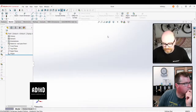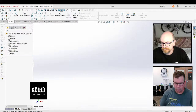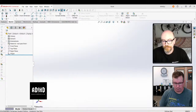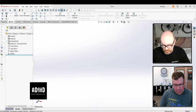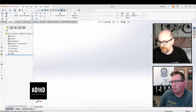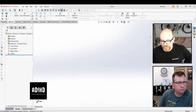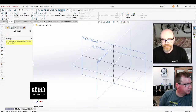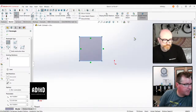What I've learned is that relations go before measurements. Well, there's that too. That is actually a huge piece of wisdom that I agree with completely. I generally use way more relations than I do dimensions. And when I do use dimensions, I almost always pull them from the global variables. That way, the sketch doesn't contain any secret information that I need to find somewhere. It's always in variables. Let me give you a couple of examples.